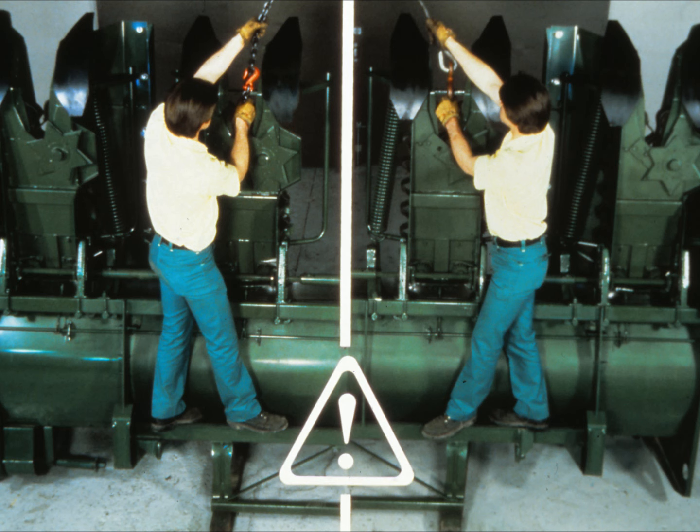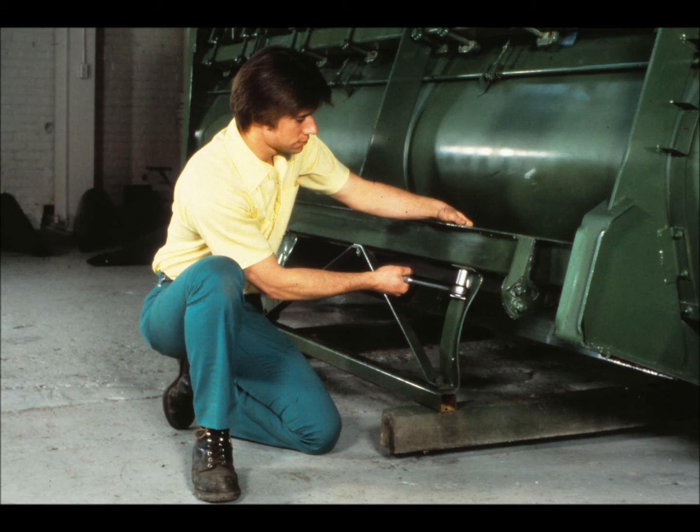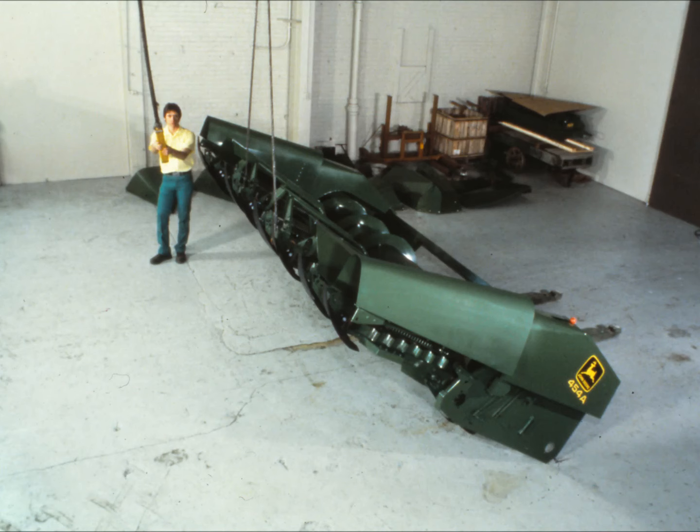Removing the shields will prevent possible damage during the following steps. You're now ready to remove the header from its shipping skid. First, route a chain or sling through the shipping channels. Be very sure that the chain is strong enough to lift the entire head safely. A sling is available through service guard tools. Attach the chain or sling to a hoist — one that is a match for the job. Raise the head just far enough to clear the skid. Remove the shipping skid clamps and uprights from the head. Then slide the two 4x4s under the top beam until they are centered.